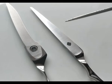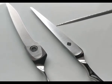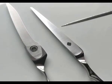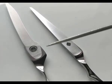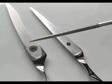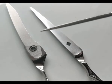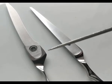Now this particular scissor here is done with two different machines. It's a concave grinder and a convex grinder, barrel grinder, and the machining time on that scissor is about 50 minutes, plus the setup and putting in the next one and so on. So there's quite a big difference in labor, and these two scissors, the price may fool you because the precision ground scissor is actually cheaper and the hand ground scissor is a lot more expensive. And a lot of hand ground scissors are actually quite cheap, but in Japan about half of the scissors are still done by hand, and luckily for us, the Japanese mostly are highly skilled and will do a good job.